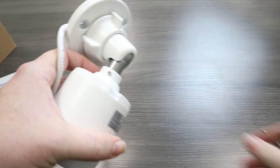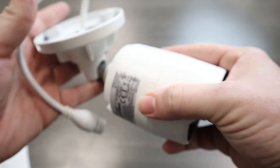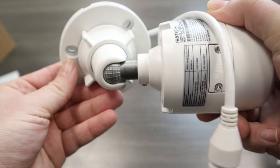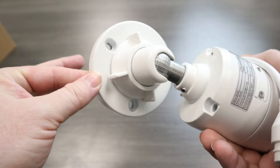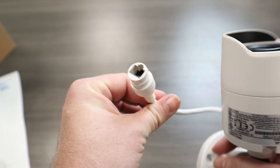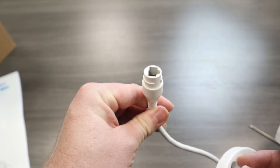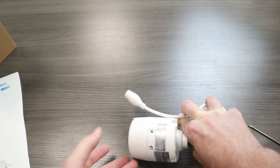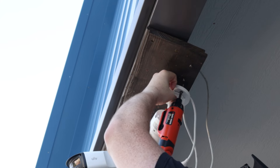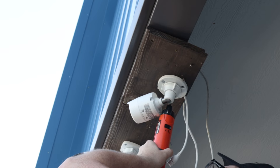The bottom of the camera has three holes for installation — super easy to install, especially with the ball and socket angle adjustments. You can unscrew that to move the lens out of your way, screw it into place with three screws, and you're done. Just like other VivoTech cameras, this pigtail has a single cable for an ethernet connection. You're likely going to be installing this with power over ethernet anyway, so it saves you space in the pigtail. Let's go ahead and install this at our test site and pull some sample footage.